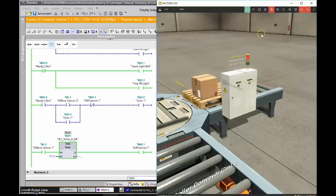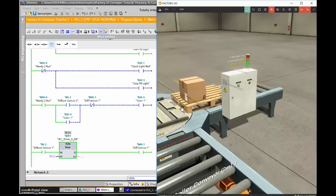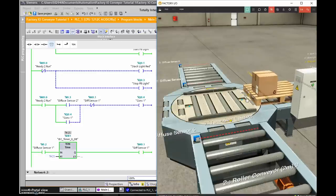In real time you can see it kept running a little longer. Now we just need to get the turntable conveyor on, and it'll continue onto the turntable. We'll need to use a limit switch — maybe that capacitive sensor — to make sure the pallet doesn't go right off the turntable.